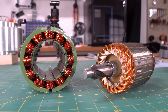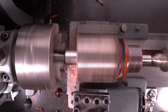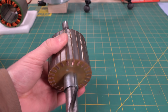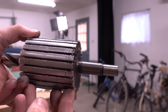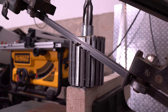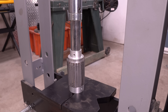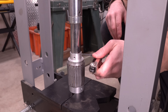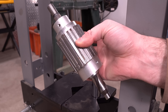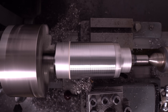The outside diameter of the armature is much larger than the inside diameter of the stator, so it needs to be made smaller. Because I had to remove so much material, I decided to make some rough cuts on the band saw to save time. Unfortunately, during this process the laminations began to separate. I worked around this by making some shaft collars on the lathe, then used my shop press to compress the laminations back together and tightened the set screws to keep them compressed. I turned down the rotor until it reached an outside diameter of 46.5mm.